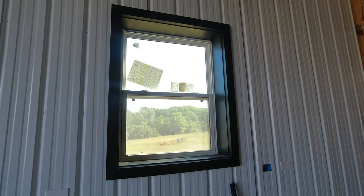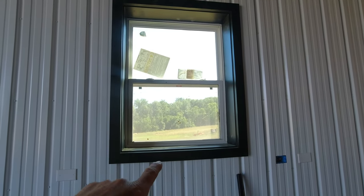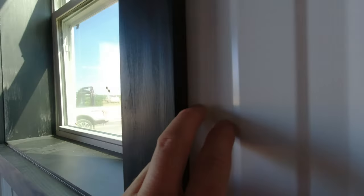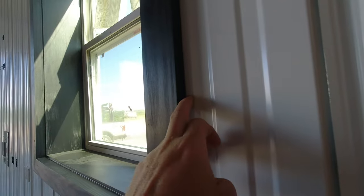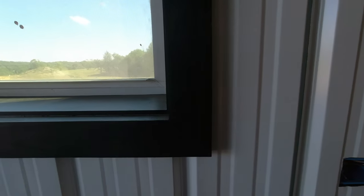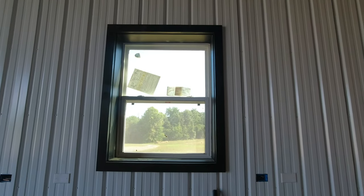Well, it's a few weeks later, and I've got a primer coat of paint on the jamb and trim around the window, and we got some metal up on the walls. You can see here how they trim out, in which I run my metal backwards. They bent this back to where it comes out tight against my lip there. I cut these right at 3 inches versus a piece of J trim, which would be about a third of the width of that. For just some old framing lumber, I think they turned out pretty good.